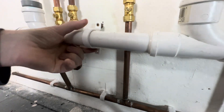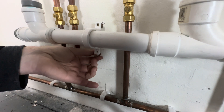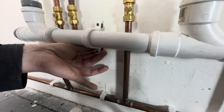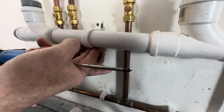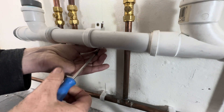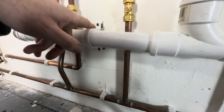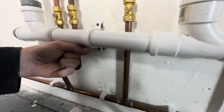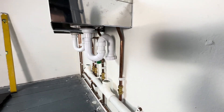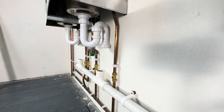When doing up the clip fittings, don't just put one in like this — for the bottom one, you need to push it upwards a little bit. That locks it all in — it's a little tip. When you do the bottom one, first work out your height, then do it and squash it upwards a little bit. The spacing has come in useful so the pipework isn't interfering — we can still turn the mixing valve on and off.